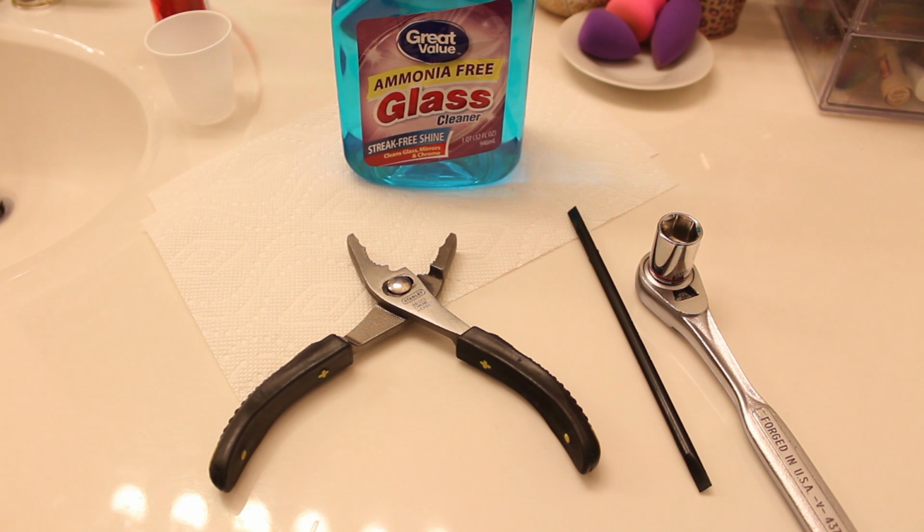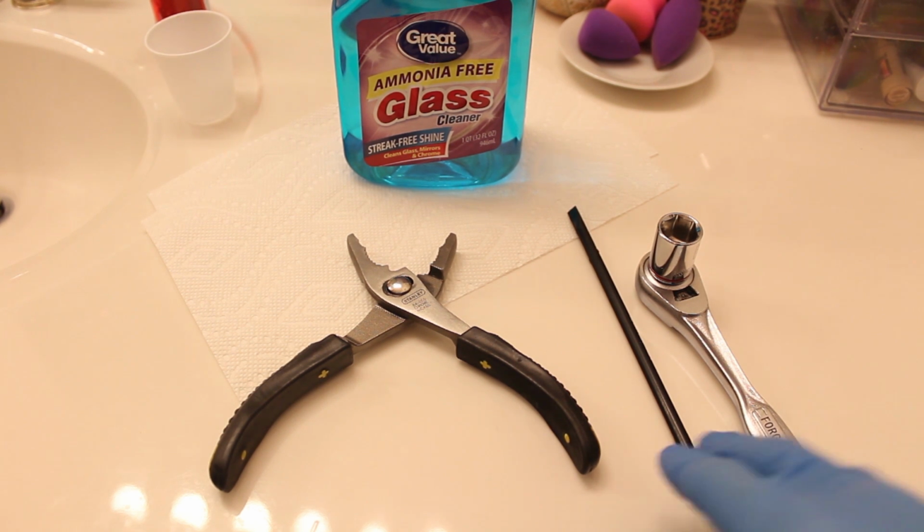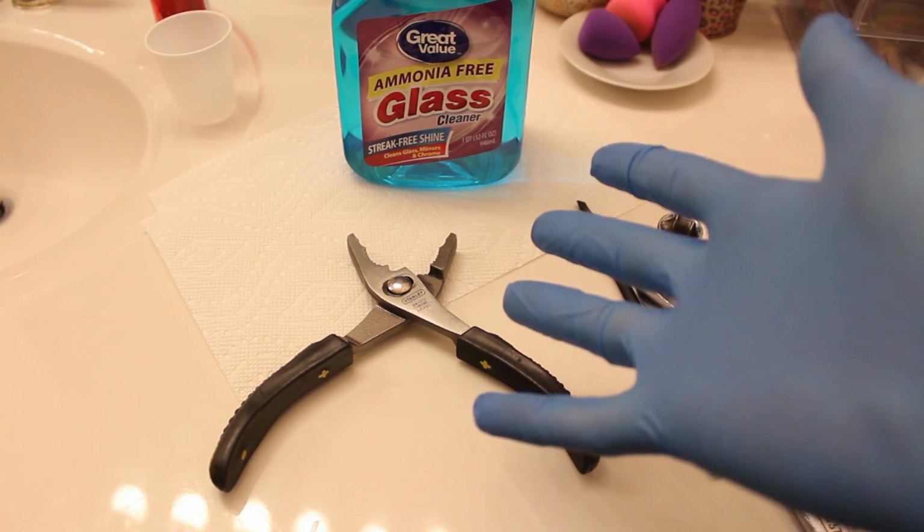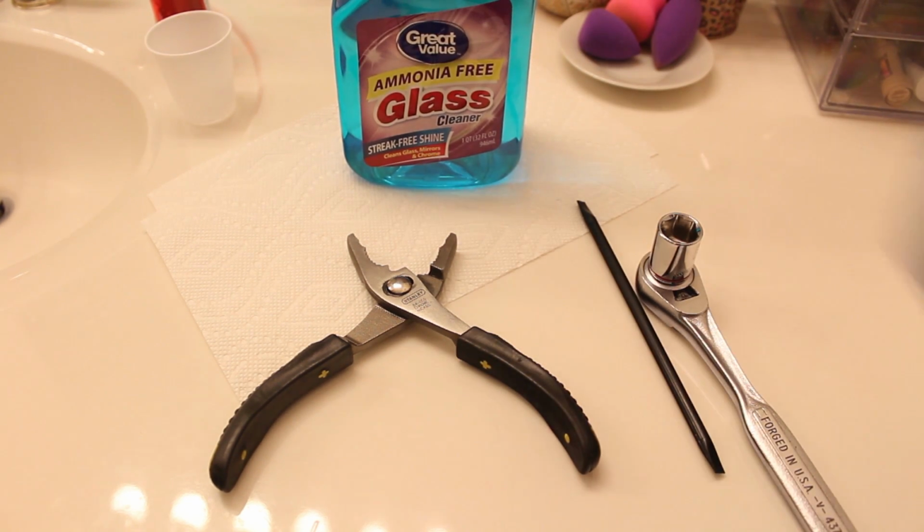So to install one of these specific lids, which by the way is linked in the description below if you're interested in the one that we have, you're going to need a few tools. You're going to need a ratchet with a 5/8" socket, a plastic pry tool, some pliers, of course some rubber gloves because you're working around a toilet, and some glass cleaner, Windex, and some paper towels to clean everything up before you install the new lid.